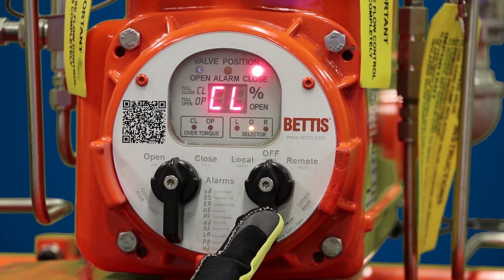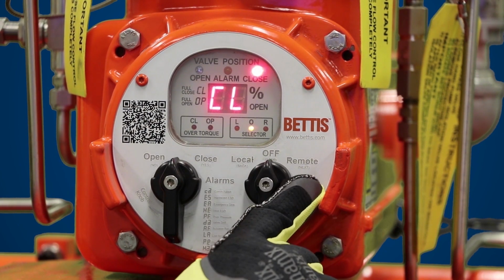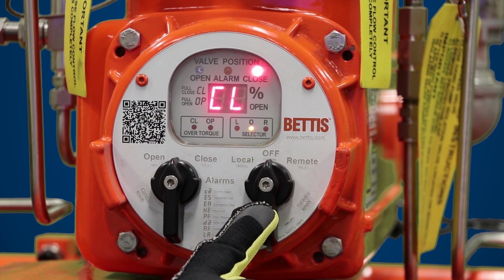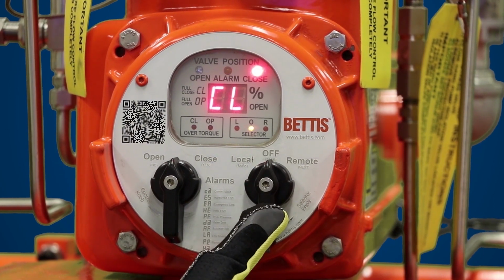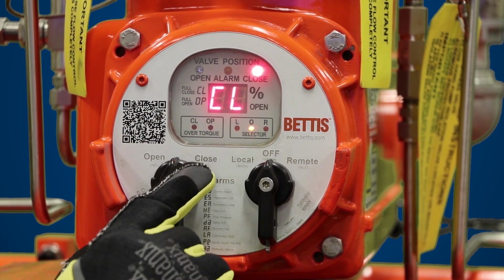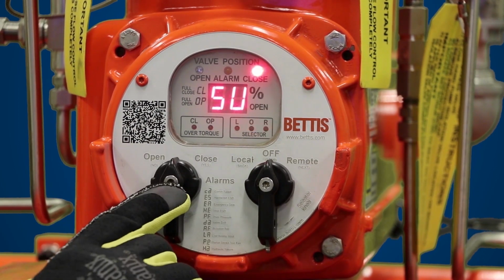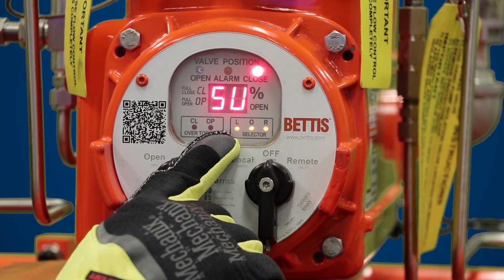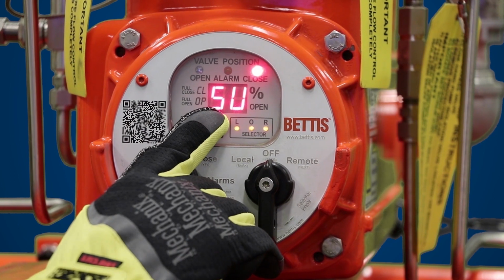On the right, we have the selector knob. The selector knob is used to navigate through the setup menu. You can go back, stop, or next as you navigate through the setup menu. In order to get in the setup menu, you want to have the navigation knob or the selector knob in the stop position. And for the control knob, you want to toggle yes, no, very quickly, like this. You know you're in your setup menu when you see the LOR LED flashing and it reads SU for setup.